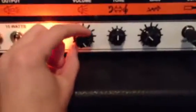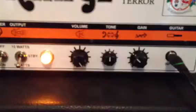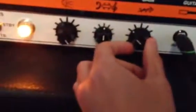Now let's go all the way up volume-wise. We're ranging about 67 to 71 decibels. If I increase the gain, we get a higher tone. So halfway up on the gain, all the way up on the volume, we're between 77 and 82 decibels.